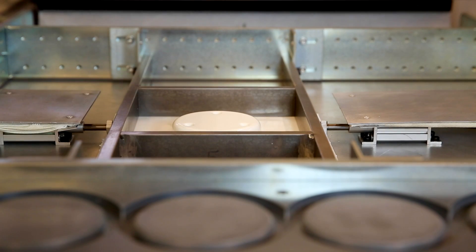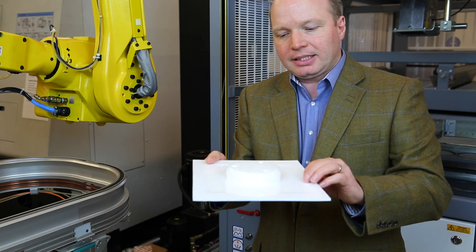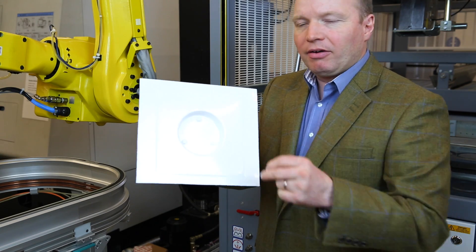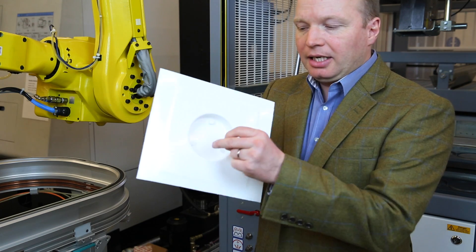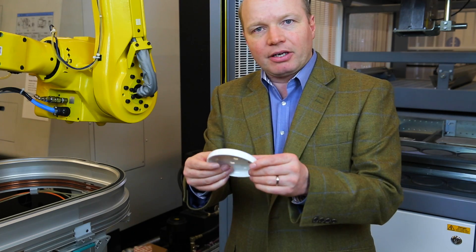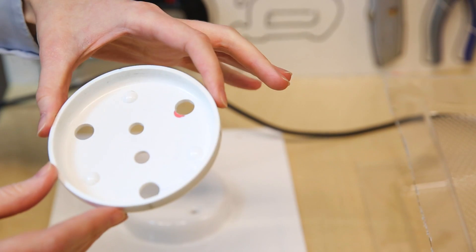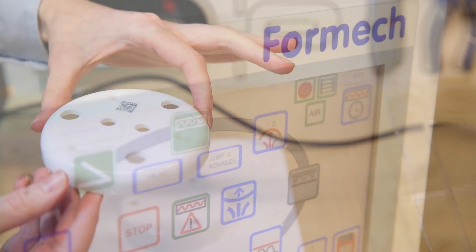In this work, it's an upper cover that goes onto a gearbox. You can see we've formed this lid and there are some standoffs in the lid that fit into the assembly. By varying process parameters, we can vary the size of the standoffs, affecting the quality of the assembly. This is the piece that goes into the assembly process — you can see we've machined the edges to leave the final component. You can also see the standoffs for the part, and we're adding an ID onto the component so we can track it through the manufacturing process.